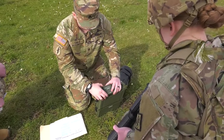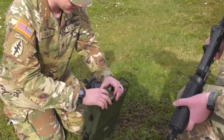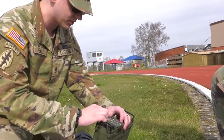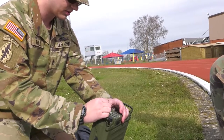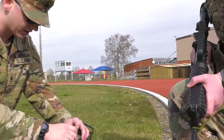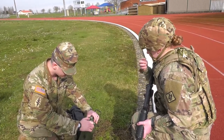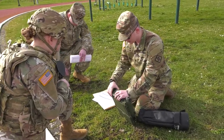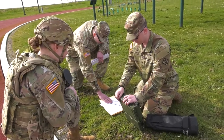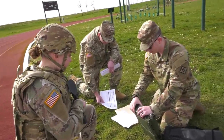It says frequency. You enter 0 and then your frequency — in our case, 75.7000. Hit enter. We're going to transmit and receive on the same frequency; the first entry was transmit and the second was receive. Receive only — no — because you want to be able to talk both ways. No COMSEC, data and voice, clear, FM. Below 90 MHz it defaults to tone so you can't change it. Power is the amount of power the radio pushes out when it transmits. The higher your power, the farther you'll go, but running off battery it reduces battery life.